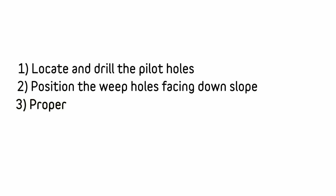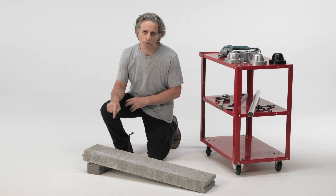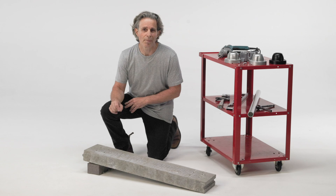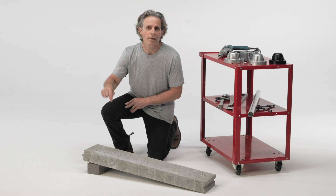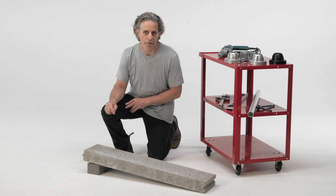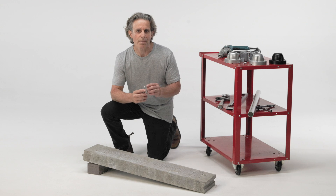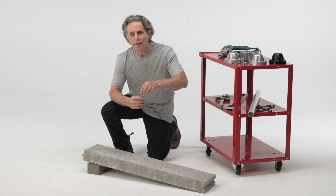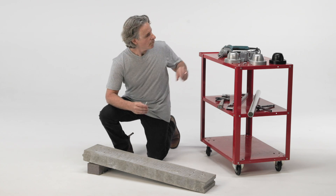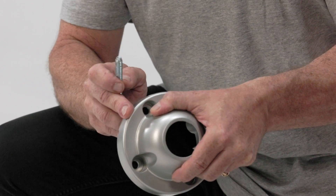The last important thing when installing the anchors is to get them at the correct depth. Ensure that the holes are drilled far enough — in fact, best to drill them an inch longer than you're planning to install the anchor itself. Vacuum out the hole very well so there's no dust or debris preventing the anchor bolt from going in at full depth. We want to install it so just enough threading sticks up out of the hole to allow you to attach the base and grab the nut, but not so much that it protrudes through the top of the post base and prevents installing the little caps afterwards.